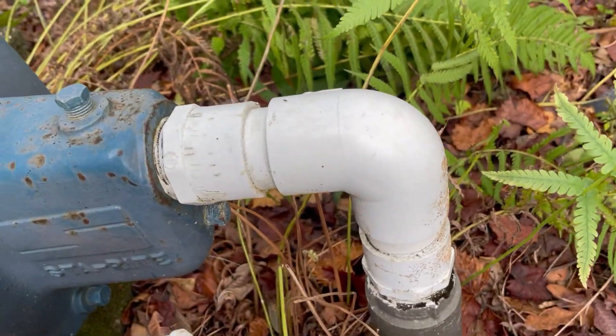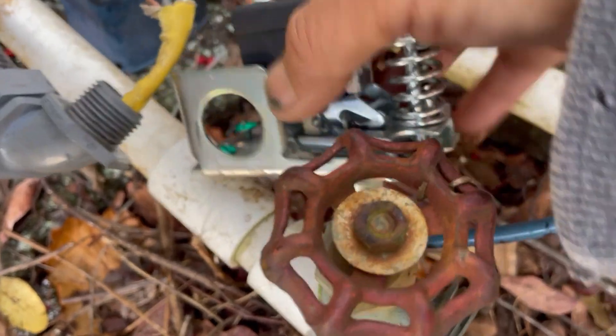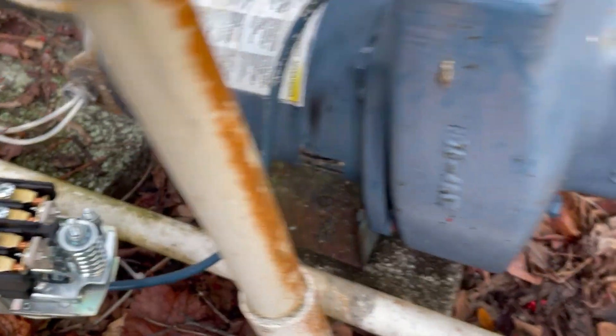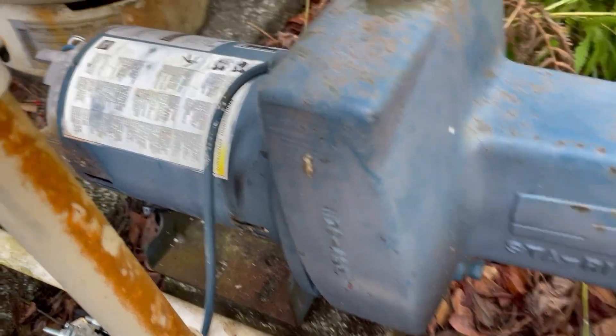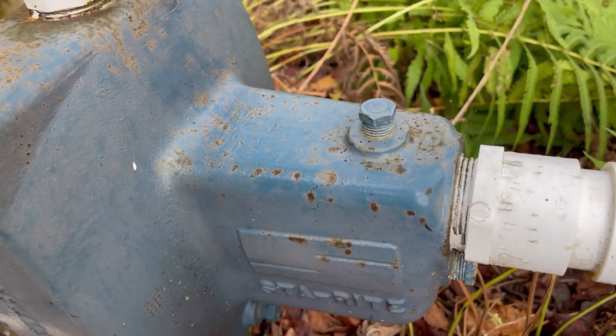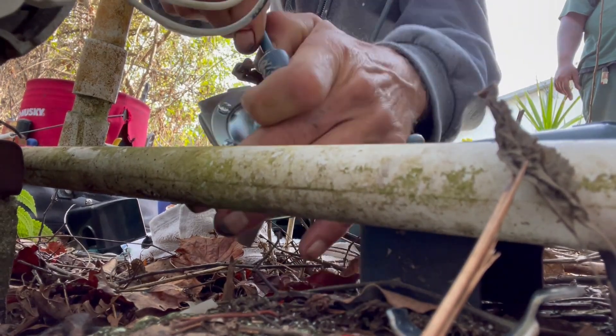Power is disconnected. The only thing left hanging on this switch is our pressure hose. If I take that off, water's going to come out. Unfortunately there's no water in the house, and the gate valve and check valve is so close in here — once I cut this pump loose we're going to lose all that water. If you know you're going out to a rural area with no water but you're going to need some to prime the pump, bring a bucket with water from your shop or somewhere on the way.